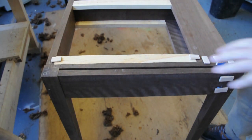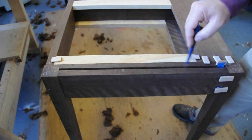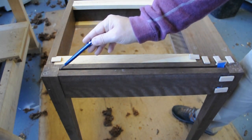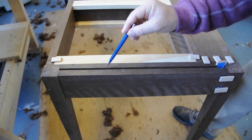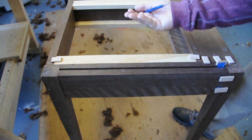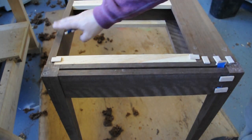This is the base of the table — the legs and the aprons. It's pretty straightforward traditional construction. You've got the aprons tenoned into the legs. Instead of a spacer which accounts for the increased width of the leg versus the apron, I leave a gap — I'll explain why in a second. Then you have the runners for the drawers, lower and upper. The lower ones are wider because they need to support the weight of the drawer. Then my front stretcher, nice and wide, and my lower stretcher here, and the rear table apron.